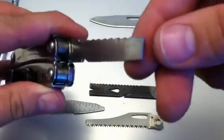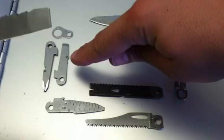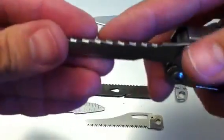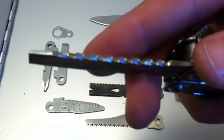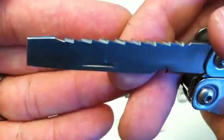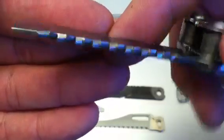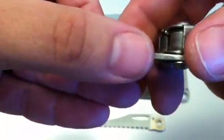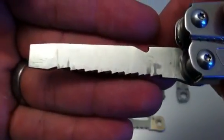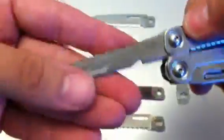It's also secondarily a large flathead screwdriver. That replaces the function of this flathead screwdriver that comes with the tool. It's about a medium in comparison. And third and final, it is a small saw. Now the saw, these are cross-cut, chisel ground, or chisel filed saw teeth. This allows for a nice deep, aggressive cut on the push stroke. The kerf of this blade is wider than the spine of the tool, which allows for the tool to cut smoothly without binding in the material. So that is the solid titanium tri-tool, 3 tools in one on that side.